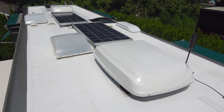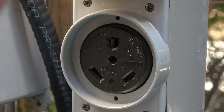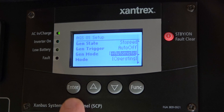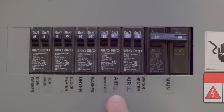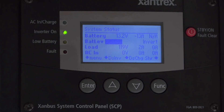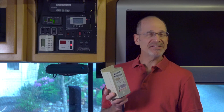Part of the installation includes powering up the air conditioners so that the Easy Start can learn the start characteristics for your specific compressor, so we prefer to do this where a power hookup is available. But you can use any power source that you've successfully run your AC unit on before. To get started, we'll shut off the power to the RV, make sure our Auto Gen Start system is disabled, and kill the air conditioner circuit breakers for good measure. In the unlikely event that your air conditioner units are wired to run off your inverter, make sure the inverter is off before starting. We want to guarantee that the air conditioners are absolutely disconnected from all possible power sources. So let's head up on the roof and show you how we're going to install the Microair Easy Start 364. Then we'll tell you how you can save $25 when you buy one for your RV, or you can check the links down below in the video description.